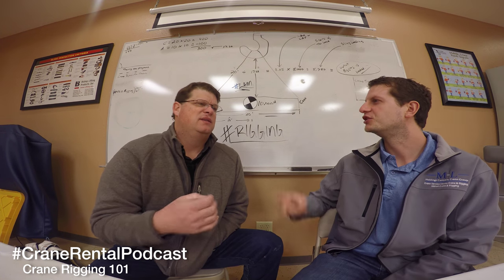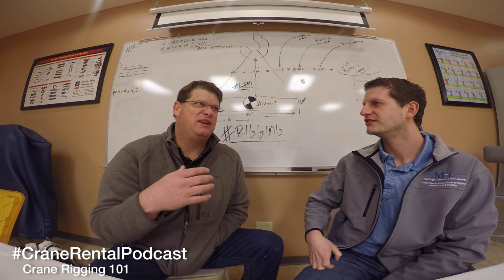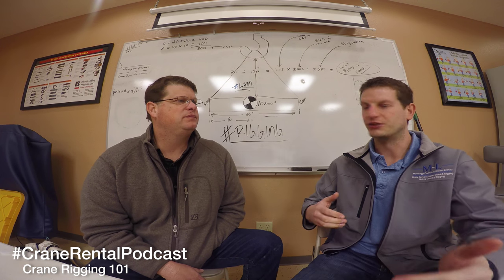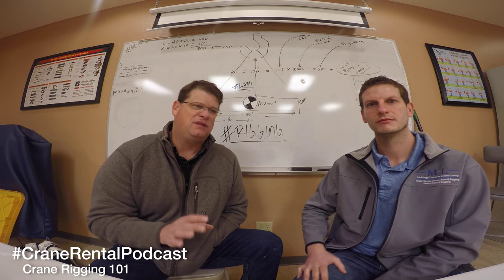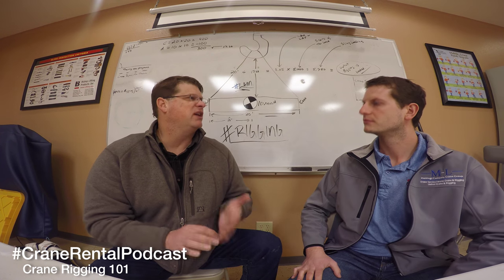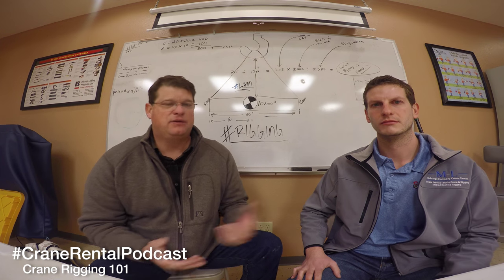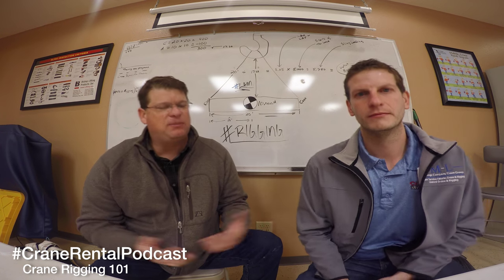So we have all kinds, but there are two basic types or top categories. Let me finish the inspection first. We did the initial, we did a per-use, and then they're also required to have an annual inspection, which is a written inspection that's documented. Our per-use inspection, for us, is a written inspection in the sense that it goes on our crane inspection logs - we check off that we did the inspection. But it has to be done at least annually, and it is done daily for us. We're required to have documentation of that inspection.